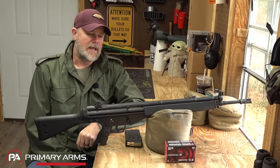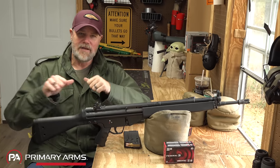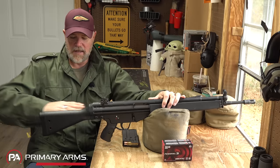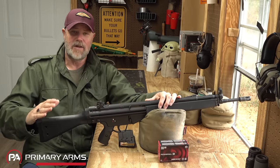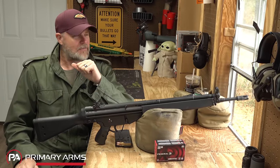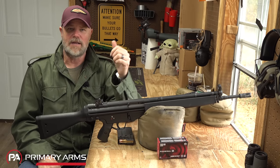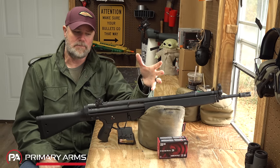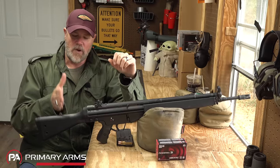Go back to when I was big into machine guns — I had an HK53 full-auto and was out shooting it. I had it strapped across my chest with the HK-style sling and the collapsible stock extended. I didn't get it fully clipped on the rear, so it disconnected, the rifle swung down, and the stock hit the ground at speed. That wire stock extended applies a lot of leverage, and it ultimately bent the receiver. I didn't know that until I fired the gun and the bolt and carrier just stuck to the rear. Being me, I found the closest tree, slammed it muzzle-first into the tree — the bolt went home, stripped a round, and fired. I continued that for a couple of magazines, straightening the gun out just by beating it against the tree. That was the first time I realized these things are really susceptible to mishandling and abuse causing potential functional problems.